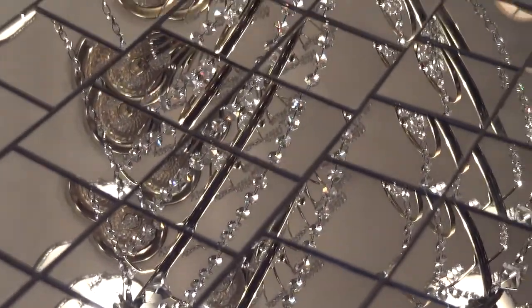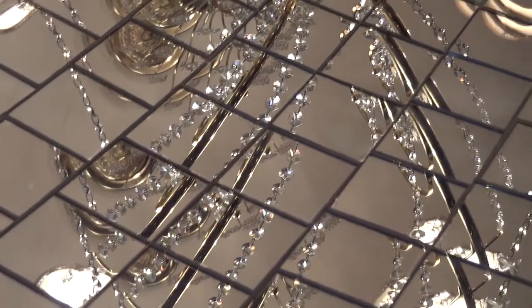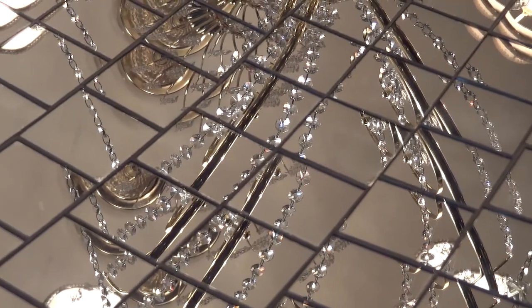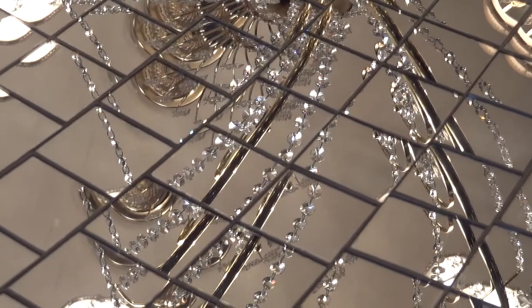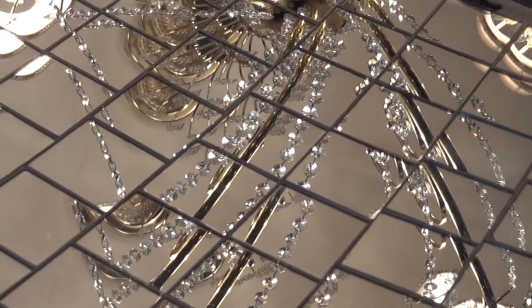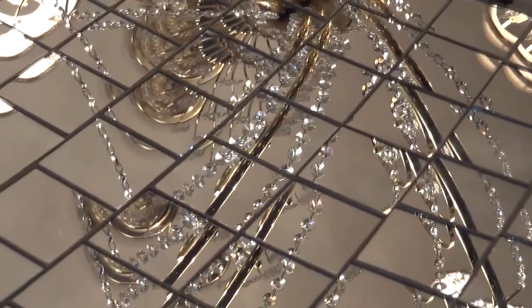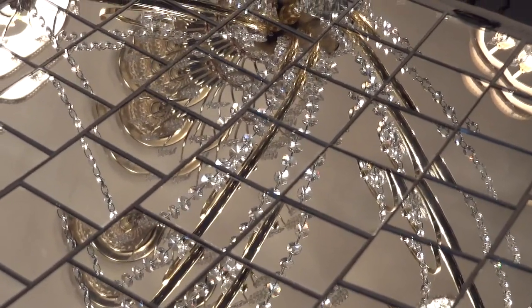Well, if you're going to buy PV, you've got to mount it somewhere. If you can make your own platform in less than a day, and it's going to not only mount your PV, which was going to take you some time anyway, but maybe cost less, because instead of buying some kind of kit, you can go out and buy thin tubing at your electrical supply or your hardware store, it quite possibly will be very, very economical. That's the idea.